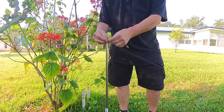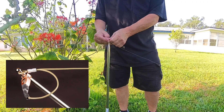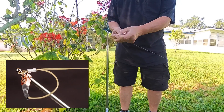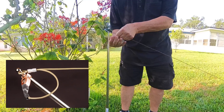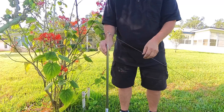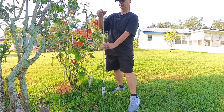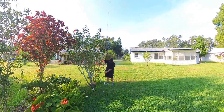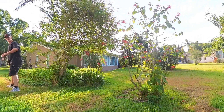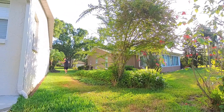Attaching the wire to the SS-17 is very straightforward. If you've used the Tactical Delta Loop, this makes all the sense in the world. The loop goes over top of the ball on the end of the SS-17 and then this clip just attaches to the metal. Now you have an electrically conductive wire with the SS-17 giving you a 77-foot antenna — 60 feet of strong extra-light 26-gauge wire and 17 feet from that telescoping antenna.